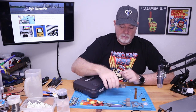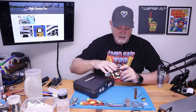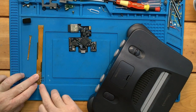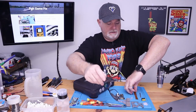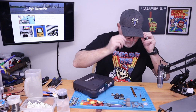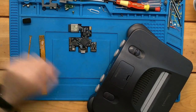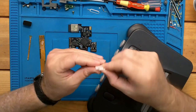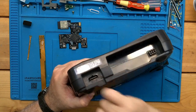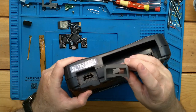As you can see, there's a board that has everything built into it. There are a couple of ribbon cables with the kit — one side got bent a little bit in packaging, but I don't think it's damaged. It looks okay, just a little bent; you should be able to push it down and solder it. There are a couple ribbons that will snap into these locations here, a little piece of foam tape, and the original kit came with this spacer which equalizes the board a bit. You would normally notch out the bottom of the shell, but this 3D printed piece is going to give us a notch just under the AV port.